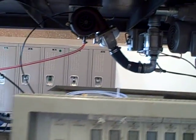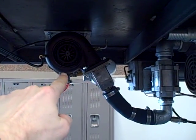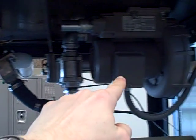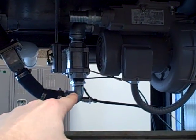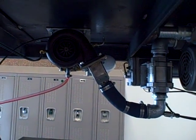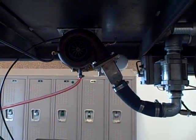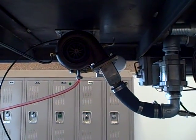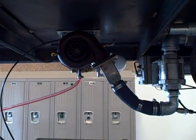The heart of the project is a turbocharger taken from a diesel engine. We do not have an actual engine to spin the turbo, so we're using a 2 horsepower air blower to blow air through an on-off shutoff valve and then into the turbine side of the turbo to spin it up. The compressor side simply spins, draws in ambient air, and discharges through a nozzle. We can suspend a ping-pong ball in the air stream of the nozzle, as you'll see shortly in the video.